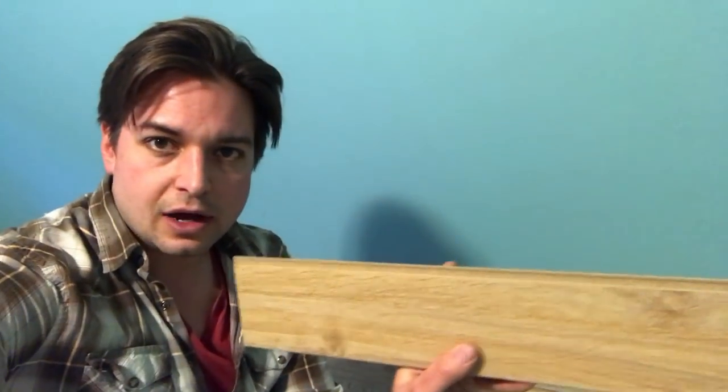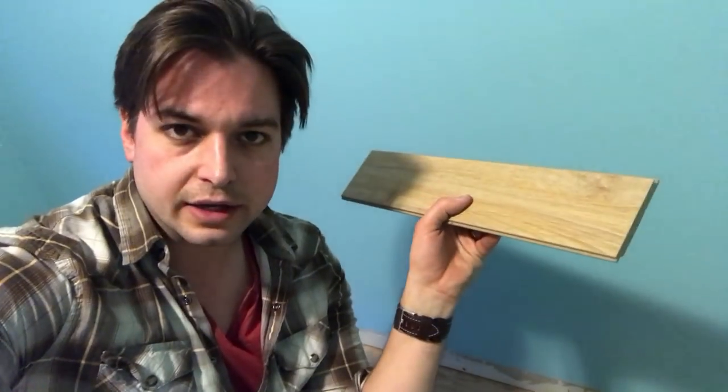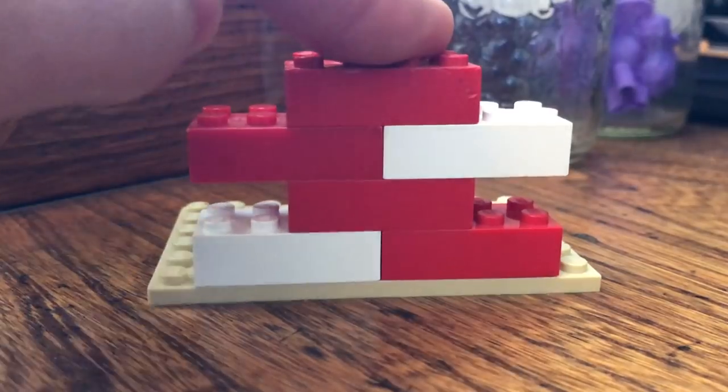Here's a trick: when you cut off a piece, you can use your scraps as the starting piece for the next row, because you want an overlap so the seams are not lined straight across. If you've ever played with Lego, if you don't overlap them they're not sturdy. So your scrap from one side becomes the start of the other, and vice versa — you just keep going. Ideally there's very little waste.